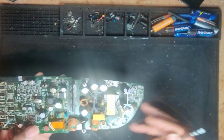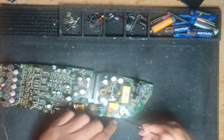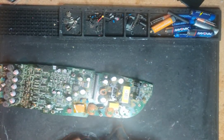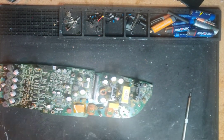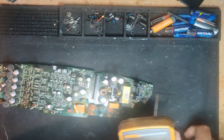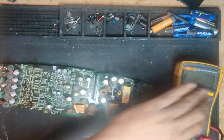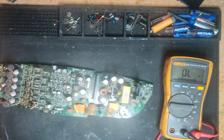You don't need power on to test those — just leave it off and test each resistor end to end. I can actually tell you what those resistors are because I kept the bad ones on the board here as placeholders, so I'd know which ones they were. Let's see if I can figure out what they are.